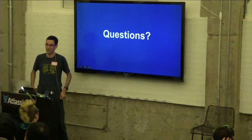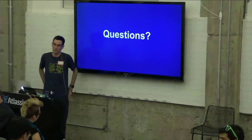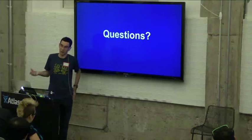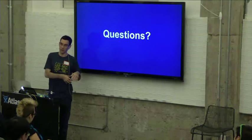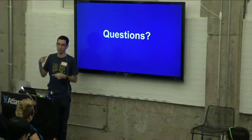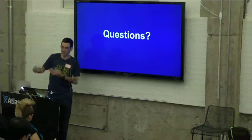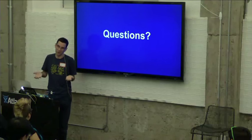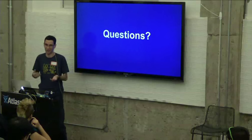Any other questions? Yeah? When you have a notification coming in at the break character from the display, what about collisions? The question was, how do we deal with collisions if we're getting notifications and trying to send at the same time? What we do in the firmware is we have the TX and RX connected on the microcontroller, so we read back the data that we send. We can detect a collision based on the fact that we're reading back different data than we sent. In that case, we just stop sending and let the Smartstrap do what it wants to do. It'll probably corrupt whatever we were trying to send, but we don't guarantee that the communication mechanism is fully loss-proof anyways, so you have to have some retry to handle that.